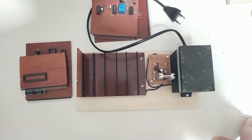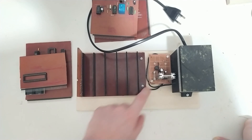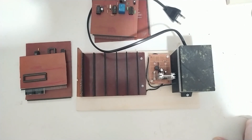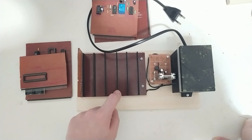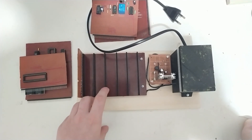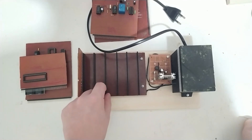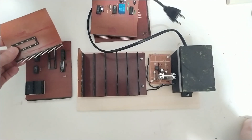So this is where we'll start for the next video — basically start where the last series started and design the power supply again, and then we'll see where we go from there. One thing that I definitely want to do is get away from these pin headers and use other connectors. I'm probably going to end up using card edge connectors because I really like the look and they make quite a solid connection. They're also reasonably cheap, although much more expensive than these pin headers, which is the main reason I chose these at first.